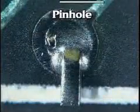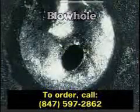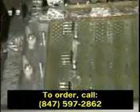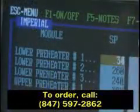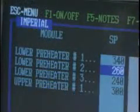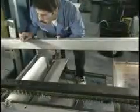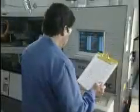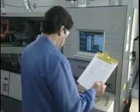Pinholes and blowholes can be caused by volatiles in alcohol-based fluxes not being evaporated during preheating. Improper preheating of water-based fluxes can result in splattering. A possible solution is to adjust the thermal profile. Other causes may be excessive conveyor speed, low solder temperature, low specific gravity of the flux, or contaminated flux. Troubleshooting means checking out each of these possibilities against the proper setup procedure. It's important to notify your supervisor when a problem starts to occur.